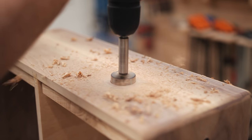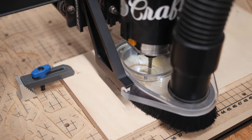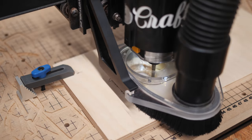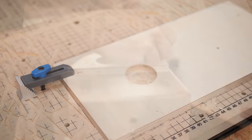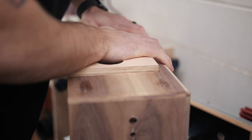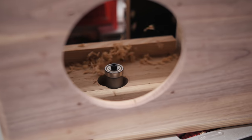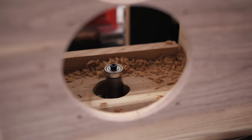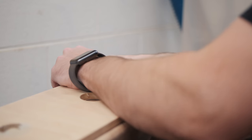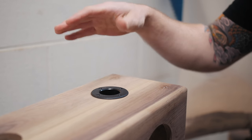The last holes I needed to drill were for the ports on the bottom of the cabinet — these ports were an inch and three-quarters in diameter, and I don't own that size drill bit, so I needed to get creative. I first drilled an inch-and-a-quarter hole with a Forstner bit — the closest size I had — then used the X-Carve to cut a template. I mounted a flush trim bit in my router table, attached the template to the bottom of the cabinet with double-stick tape, and routed out the hole. You could just buy the correctly-sized Forstner bit, but I couldn't find one locally. This saved me about 20 bucks, and I thought it was a pretty clever solution.